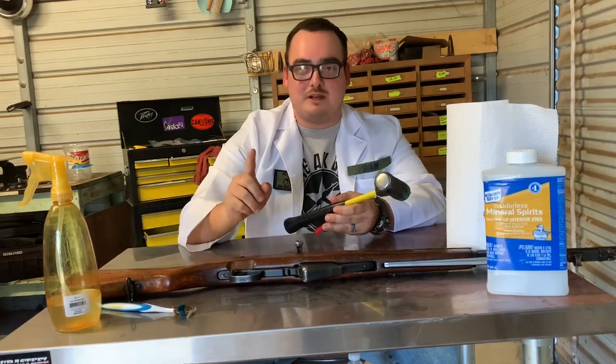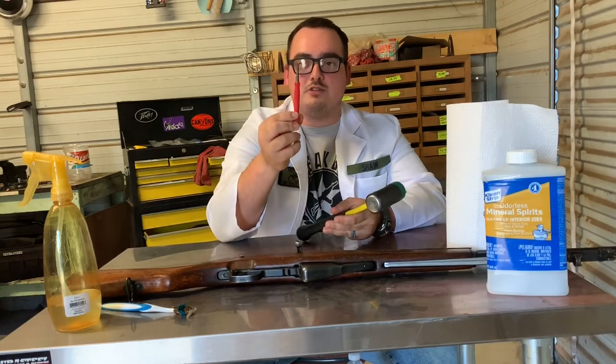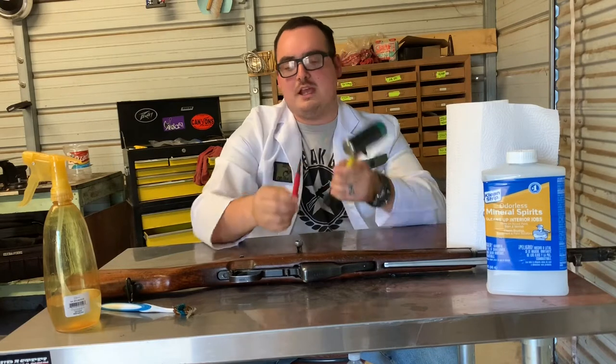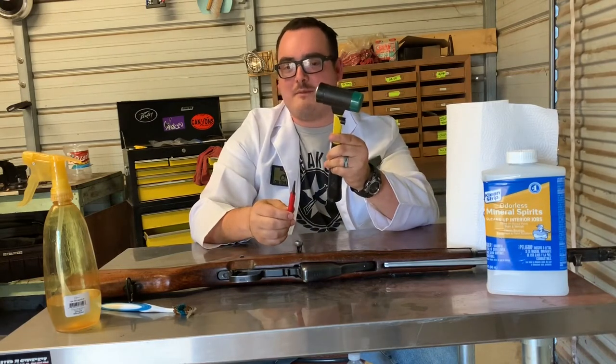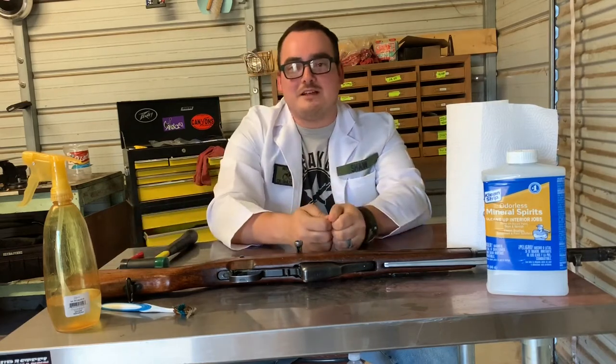The last thing you'll need is a little brush — a toothbrush works great. This one looks like I've been cleaning sewers with it, but it's actually just cosmoline; that's how nasty this stuff was. You can get these for less than a buck at Walmart. Q-tips work great too — I don't have any but I did use some. You'll also need a punch or some tool to take down the trigger group, and you may need a hammer depending on how tight the pin is.